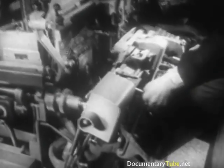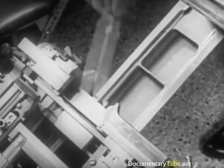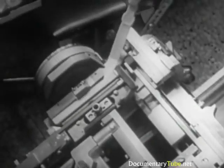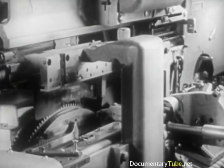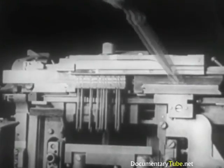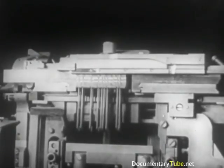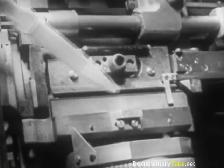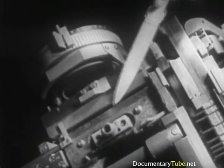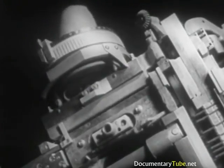In front of the mold disc there is the vice frame that can be opened when necessary. Important parts of the vice are the first elevator, the vice jaws, the justification block, the knife block and knife. The first elevator jaw is so arranged as to receive the line of matrices from the delivery slide and to lower the line between the two vice jaws. The jaw at the right is fixed, while the one at the left is movable. The latter, set in advance, determines where the left end of the matrix line will be positioned with respect to the mold opening. The justification block, driving the space band wedges upward, spreads out the line of matrices. Two vertical knives trim the sides of the slug — one knife is movable and the other stationary. The movable one is adjustable in advance according to the type size.